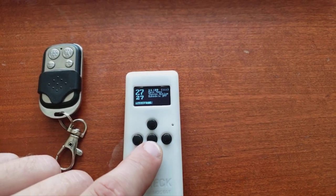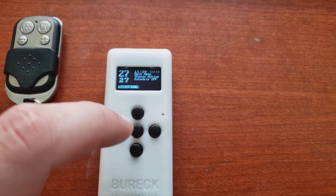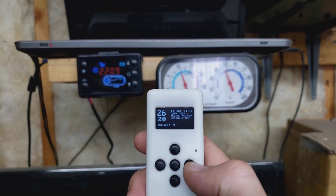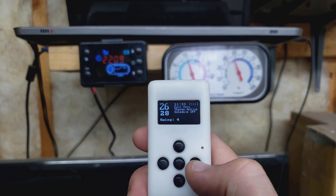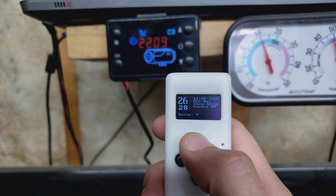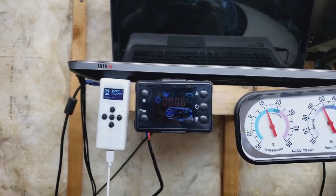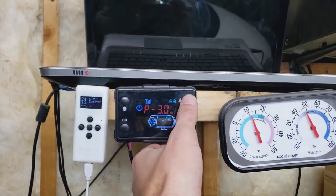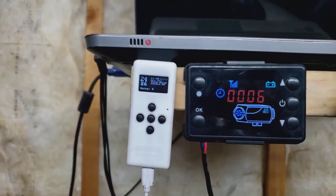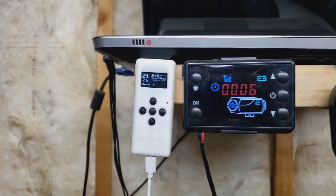There's no real limit to what you can set this to — you could make it an oven in there if you wanted. Here I am at the heater. We got an accurate reading; that's due to the temperature reader being inside this unit. It's not ideal but it works fine if you have it mounted on the wall and you're not charging the battery. Battery also messes with the reading. It's working and confirmed paired with my machine. I'm going to set the swing to about four and turn the target up to about 26 — this is definitely going to trigger in the next little bit. This is the true temperature. Let's see what happens; I'll be back in an hour.